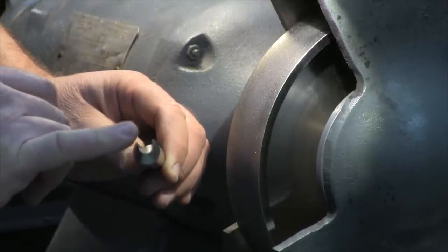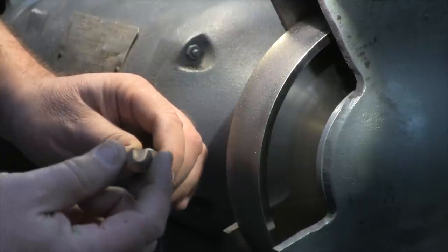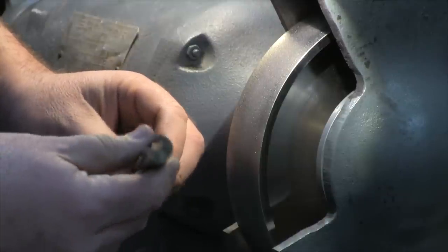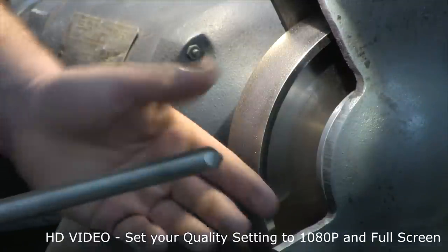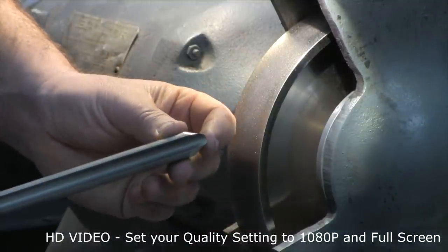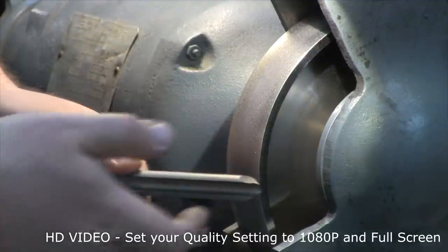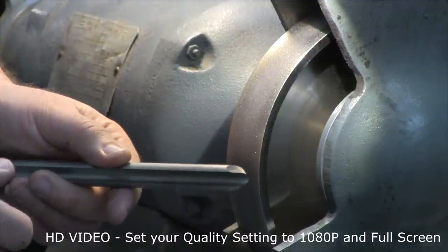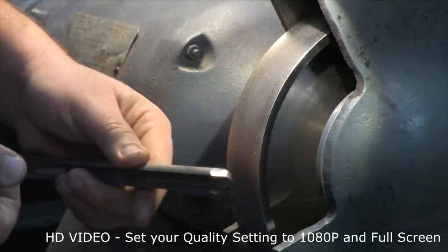In addition, rather than having a wide open V, the V is narrower, giving you more support on both sides. It also has the effect when you're inside the bowl — or even outside — that you have a very narrow tip. So as the wood comes along and gets cut, the chips get ejected very quickly and very efficiently.